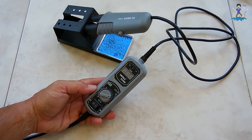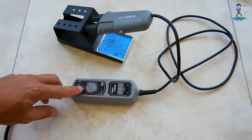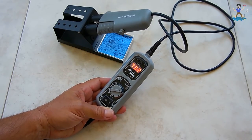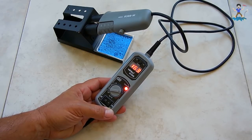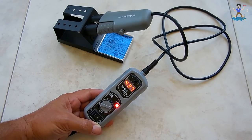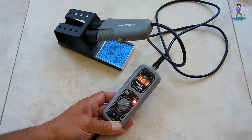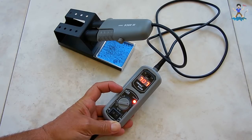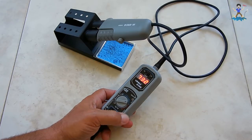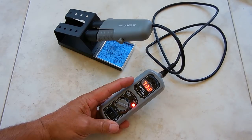Over here is a full temperature control. Fahrenheit or Celsius. And actually, let me turn it on and show you. Take that off. Set for 732. There it's heating up. And it does heat fairly quickly. Move this hair that way. Says electrostatic discharge safe right over here. Okay, it's off. And you're going to see this blink on and off to maintain the heat on the tips. There it goes. It's heating up again to maintain that 732.